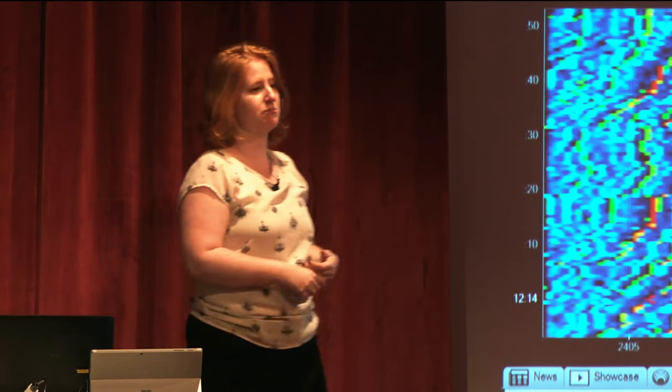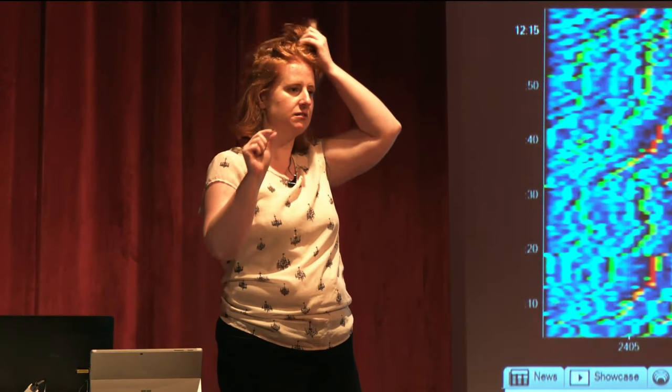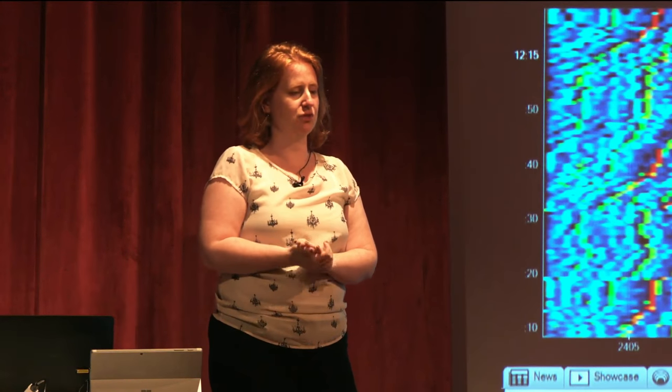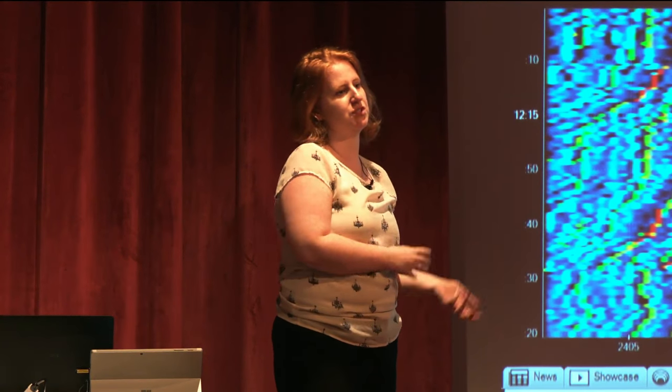Now, let's say you need more than one adaptive hopping universe. What you can do, and it takes, again, a little more planning and setup, is change the wireless ID on the front to the C, which stands for custom. And once you're in the custom, you have your choice of over 100 wireless IDs, including 4 that are adaptive hopping. So if you really want to do the adaptive hopping, that's definitely a choice. Again, we do recommend that you find something that's in a permanent space because that's going to give you more stability over time.